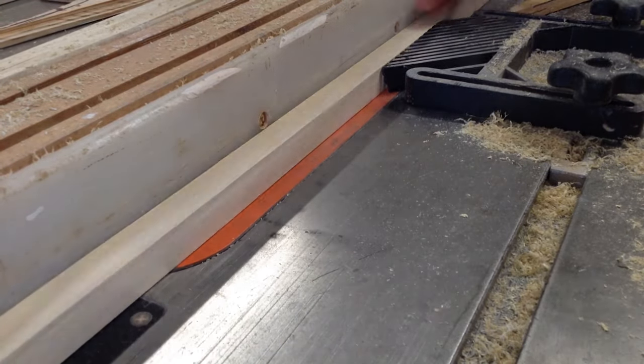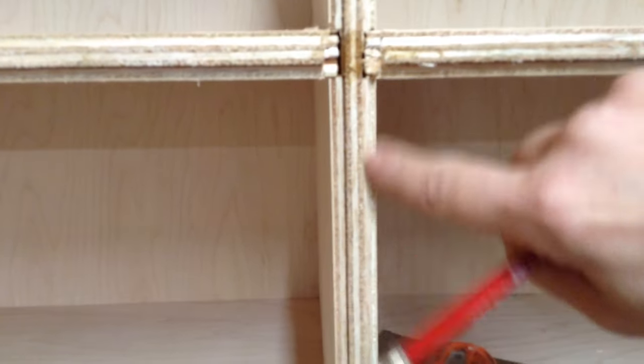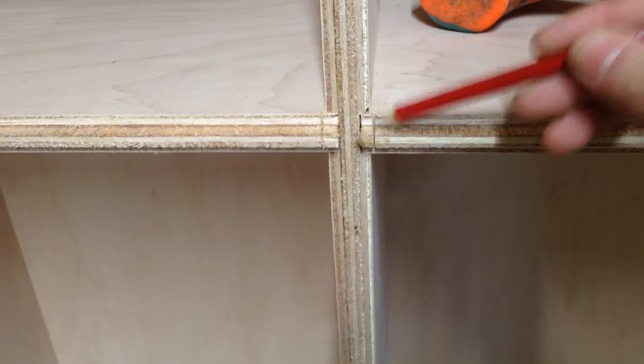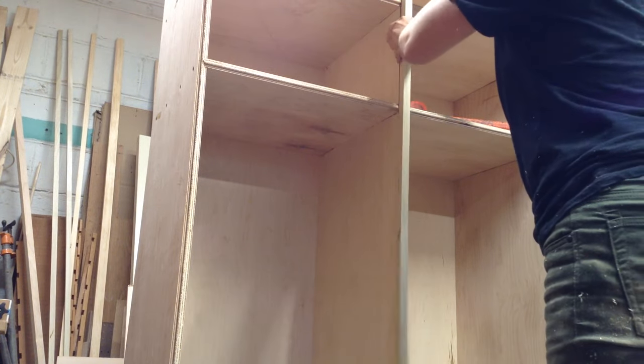I had this whole thing done — minus paint, the laminate, and the torsion box — in less than a week. The install was a fraction of the time because of many factors you'll see later. To attach the face frames I have to go through and remove a little bit of the tongue that intersects where the vertical units butt up against the horizontal units. This is plywood so it's really easy to just mark and chisel away that extra material.